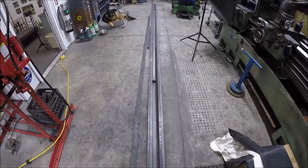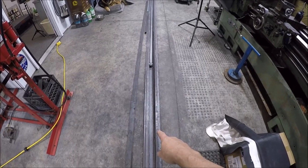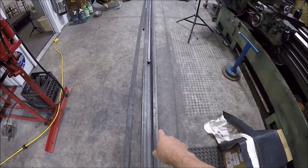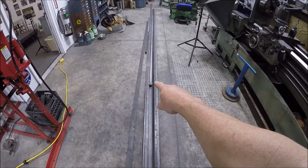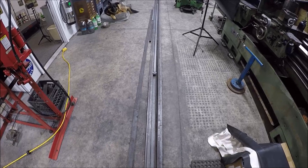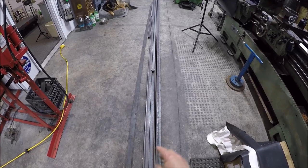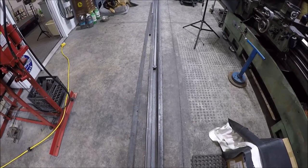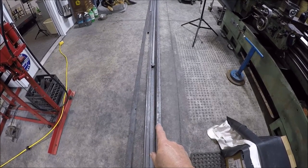Here's the stock I picked up. We're going to make it out of two-by-two, 3/16-inch thick angle — that'll be the main frame. I've got some one-and-a-quarter by one-and-a-quarter left over for supports. I also picked up a bunch of machine feet from McMaster-Carr for the bottom of the stand, and I'll need three feet for the airy points, so seven feet total. Let me get this stuff cut up and then we can start welding up the frame.